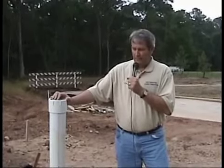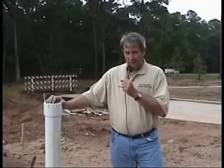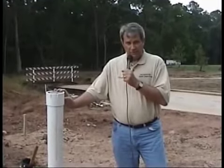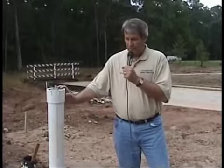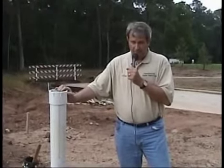This is your sewer cleanout cap here. It's got to be capped always from the top, to prevent people from popping bottles, debris, whatever down here. Now, this will be the last thing that's done in the building. Once it's been framed, insulated, etc., they'll cut this down to ground level. They keep it high just to prevent a backhoe or other construction equipment from running over this thing and knocking the cap off. Your job as inspector is to make sure it's capped at all times when you're inspecting it. If it's not capped, you need to holler.